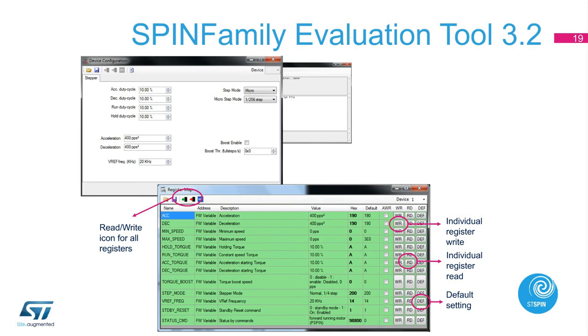The third window on the right is the script editor window for writing scripts in Python language. This feature is very useful for prototype testing, especially if we already have an entire system ready and we'd like to test the performance. A good example would be running a cycling algorithm in an infinite loop for several days, testing different motors in the application, or simply finding out what the limits of the system are.